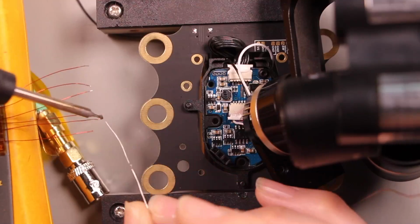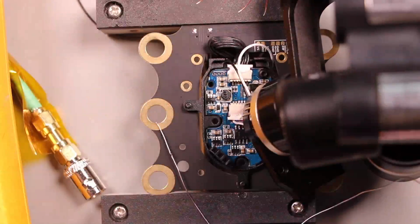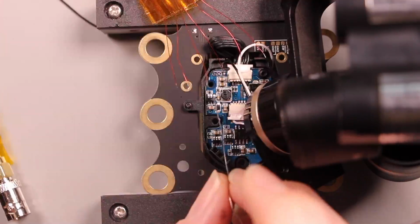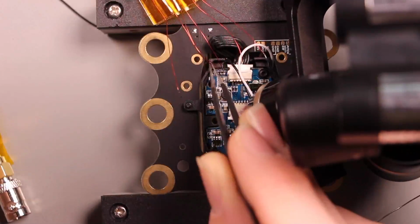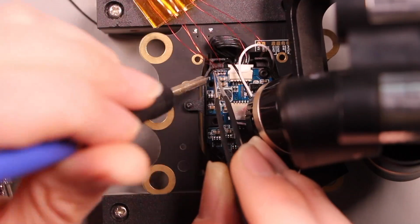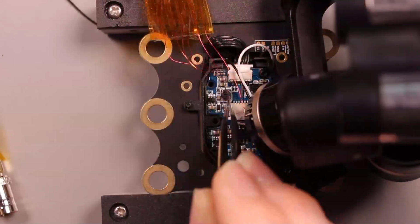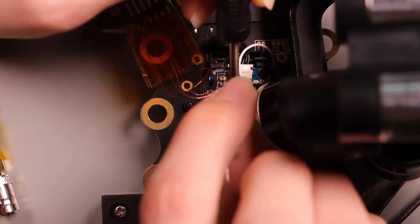This gimbal has 3 separate control systems basically, but they communicate over a serial bus, and there's some questions as to how the messages are processed, like what jobs are done by each of the 3 microcontrollers. To sum this up, I think that spying on the traffic between, at the very least, the first microcontroller and the second one, which is easy to get to without taking that much of the gimbal apart, would give us some really good information that we could use to try to find useful commands in the protocol that we're using.